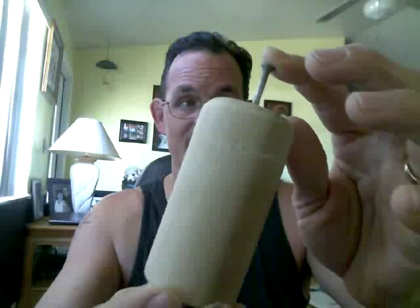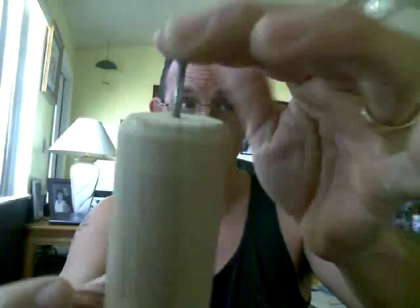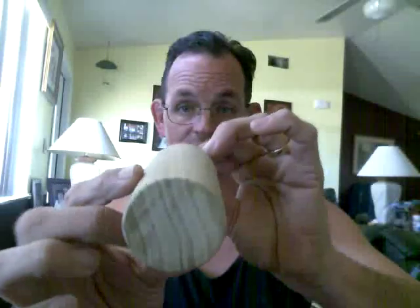Now that I've done the basic shaping, I went out with the grinder and held it at a 45. I'm not going to do that part on camera because it's loud and silent footage is boring. I grind the edges down at about a 45, top and bottom, and smooth it all out with sandpaper or a sanding block. It's maybe 10 minutes - it's got a blemish here and there, but those disappear as you refine it. I wanted to get the basic shape and bring out some of the grain so I can find the personality points in the pipe - figure out how it sits, where to place the shank and hole to feature the best aspects of the wood.